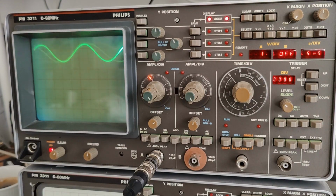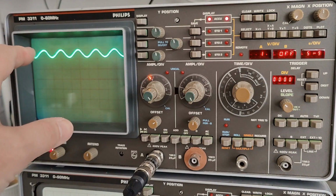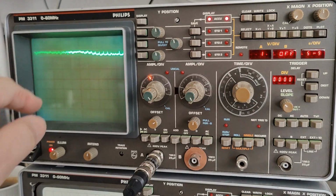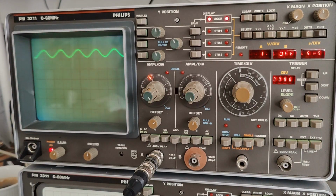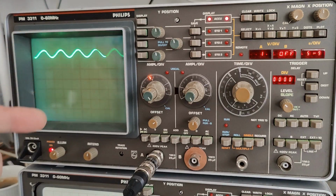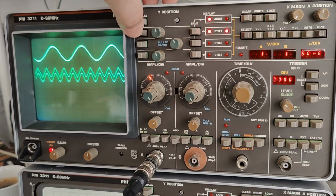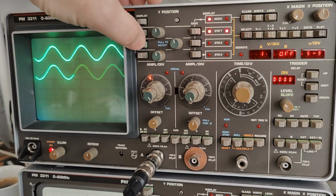Okay, so let's go back to 60 megahertz, 70, 80, 90, 100. Remember, the front end is 125 megahertz, so 110 and 120, and it's gonna go like that, 110 again. So there's a very good restore filter here that is restoring the signal, so that is 60 megahertz. So all that seems to be working. Can we even? Yes, we can.